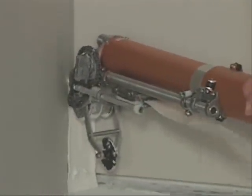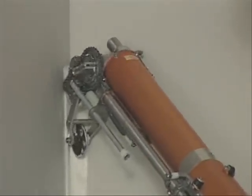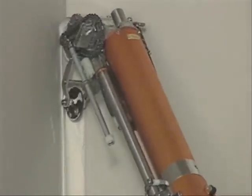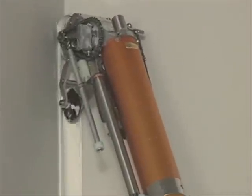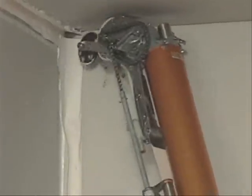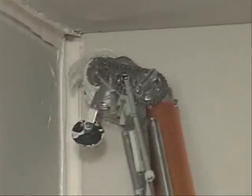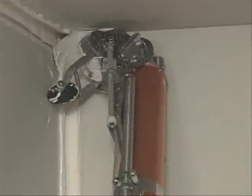In corners and angles, start with a longer tab of tape. Run out a few inches along the angle and then engage the creaser wheel to guide the tape into the angle. Keep both drive wheels in solid contact with the adjacent wall surfaces and the taper running in a straight line. If you twist the head, the tape will slide.